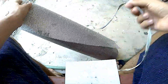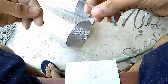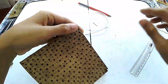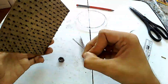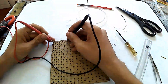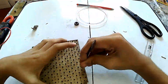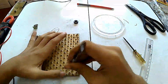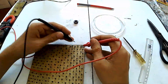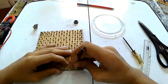For aluminum, I couldn't find any wires or string, so I cut thin strips from an aluminum sheet into 4-centimeter-long sections. The connection method was straightforward: insert the aluminum strip into the hole left between two graphite pieces, connect the upper end of the aluminum to the upper part of the left graphite, and the lower end to the lower right end of the right graphite, and so on. This is kind of the most frustrating part of the entire project.